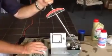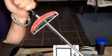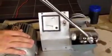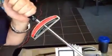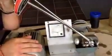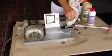You'll remember that at 40 or 50 Newton meters, the untreated oil was broken and the motor seized. Well, there you go. We still don't have any load on the ammeter. Let's do some shock loads. Let's have a look at this wear scar. If you get up close, because you're going to look real carefully now, it's a very, very small wear scar. Way, way smaller, and that was with seriously contaminated oil.